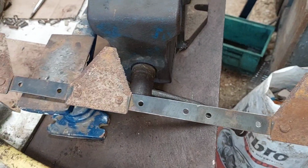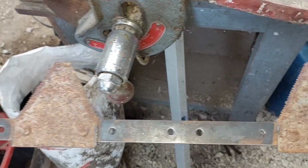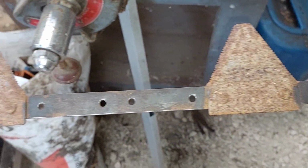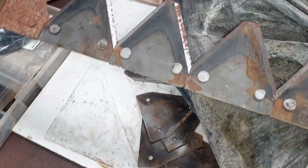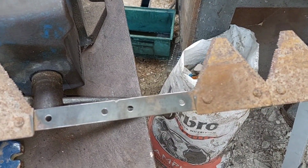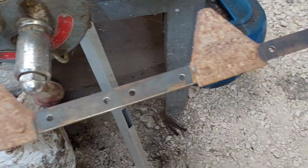So, as I always do when I'm doing knives, I clean the back of the section. Obviously, with old sections, they've been sitting around for a while, and they get a bit of rust on them, and I clean all that off because when you're using it, the movement will just file away the rust a bit. Whereas if you've got metal to metal contact, it's a nicer type of contact that's more likely to stay in position.